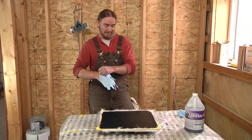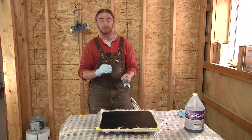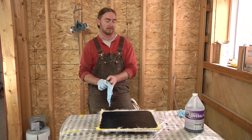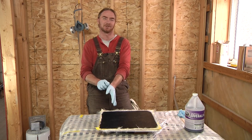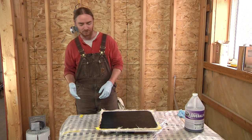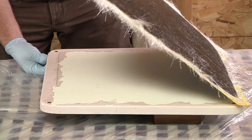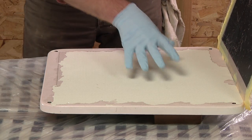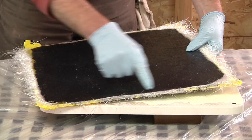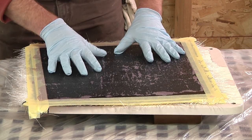I think I'm ready to try this. This is still the same day as when I laid up the glass — it's been about four hours since I laid up the glass and about two hours since I laid on the PVA. I can still pull this off and let it sit overnight and it'll continue to do its thing. But before I check out tonight, I just want to make sure it's actually going to pull off of this hatch. Oh hell, this is popping right off! Let me trim off some of this excess glass and then wash off the PVA so we can really see how well the texture printed into this mold.